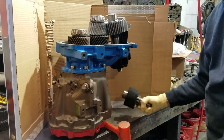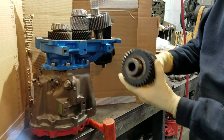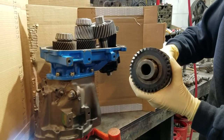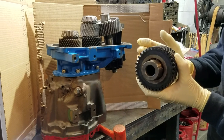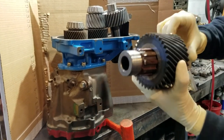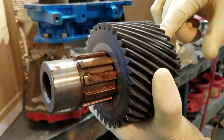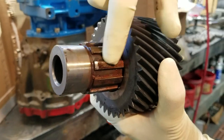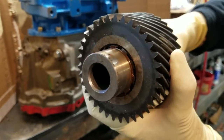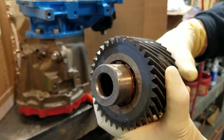One of the reasons we're replacing and repairing this one is because this is what happens on almost every V-Drive. If you zoom in here, you can see that the splines are all worn and so will be the gears. It's just a poor design that they did back in the 70s when they designed these units.